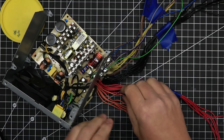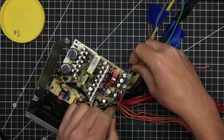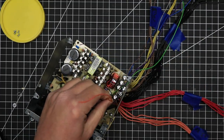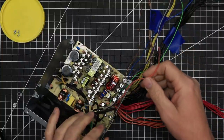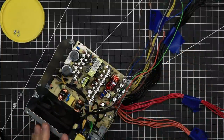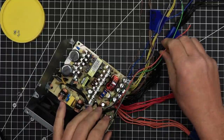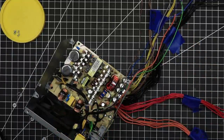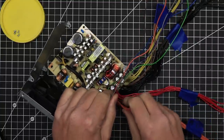You will certainly have more wires than you need, and you can cut some of these wires and insulate them inside of the power supply if you wish. But for the sake of carrying plenty of amperage and for the sake of ease, I decided it best just to keep all of the wires intact and connect them into the new power supply system. It's helpful to know the power output of each voltage circuit.